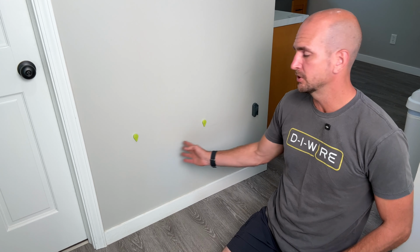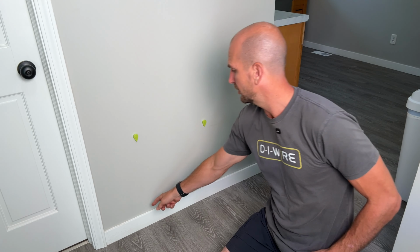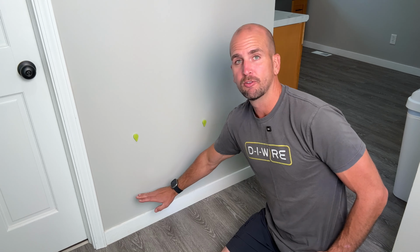And if you just have a normal stud finder, you can also use masking tape if you don't have this exact one. Well, 2 main reasons you want to find those. One, when we go ahead and pry the baseboard from the wall surface, you want to do that at the stud locations. That's going to be the most structure behind the drywall.